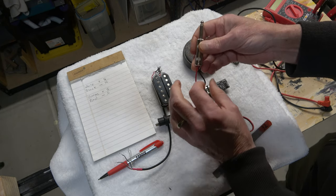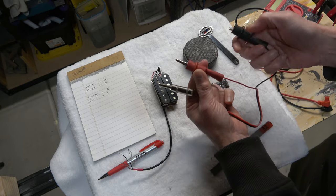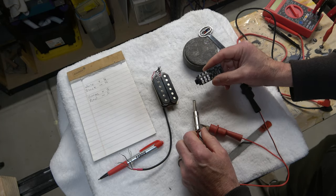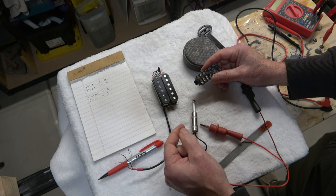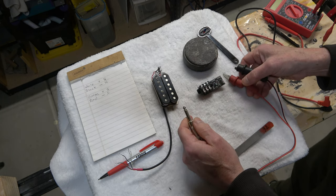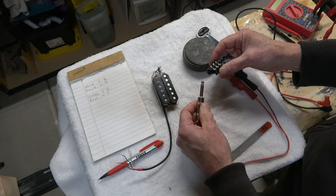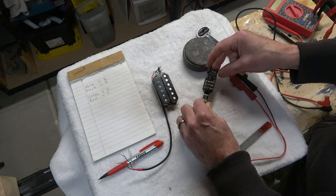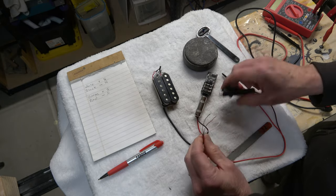The testing harness has two wires soldered into it — a black going to the ground lug and a red going to the hot tip lug — with a red alligator clip and a black alligator clip on the other ends. I'm hoping the company that makes this tool will offer it with this type of testing harness, since it doesn't come with one right now, but you can fabricate it yourself. You simply insert the jack and the red light on the negative pops on — that just means it's getting power.